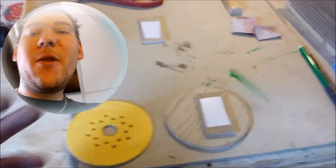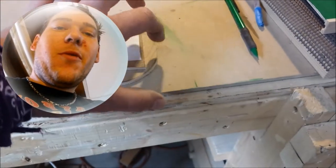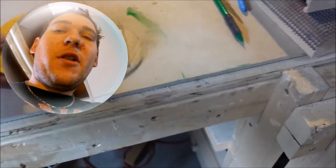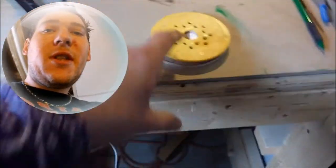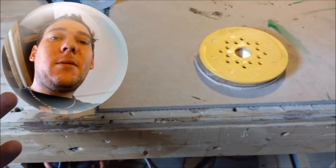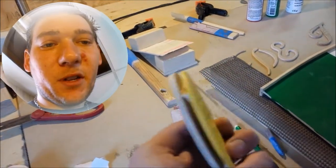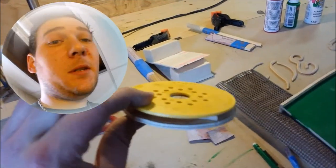So what I'm doing now, before we go to the router, is putting these spacers in to allow our cut piece to have full contact with the blades on the router bit. These are just another piece of quarter-inch plywood. I double-stick tape them to our work piece, and then also double-stick tape all that to our template. It's crucial that this template still be lined up on top with our pencil line, because otherwise we might miss it — we've cut only about a sixteenth or so outside of our line. If it's more than a sixteenth off, you're not going to get that perfect circle. So there is our sandwich that we will now take over to the router.